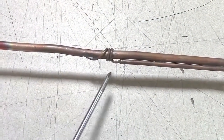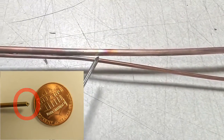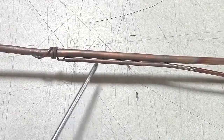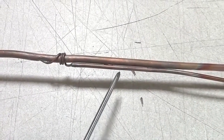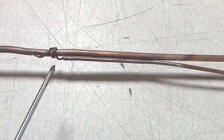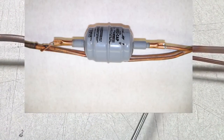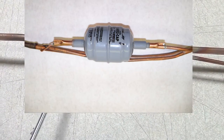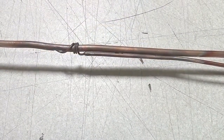Due to the very fine bore inside the cap tube, any debris or small particle in the liquid line gets forced onto the end of the cap tube and will most likely clog it. Evacuating the system will not clear any debris from the cap tube. You will have to install a cap tube filter in this area — we have a kit available at Coastal Climate Control for that. It must be done by a technician, and that will eliminate the problem and stop any further blockages if there is any further debris.